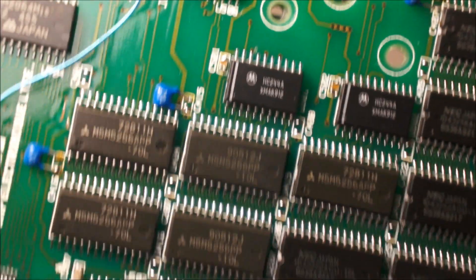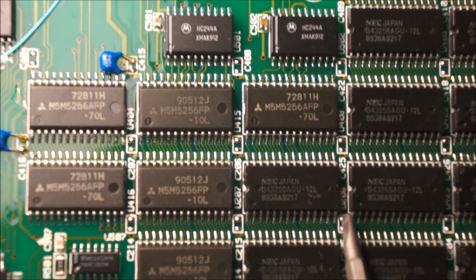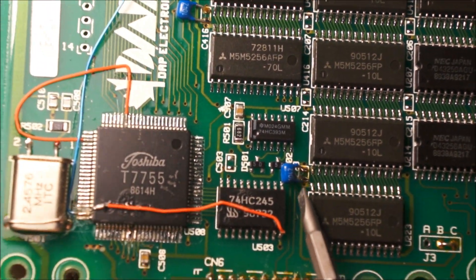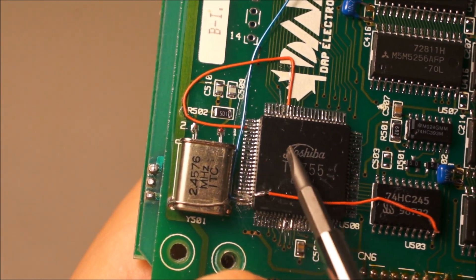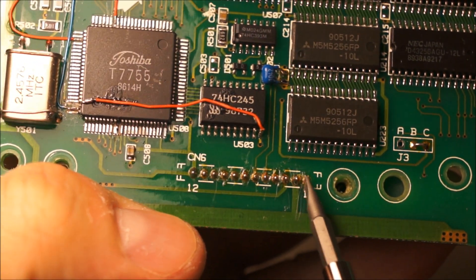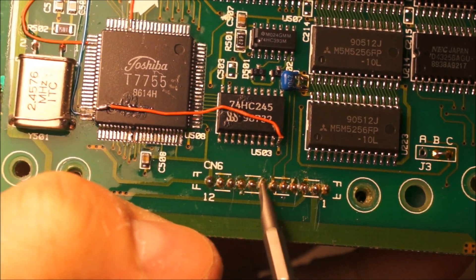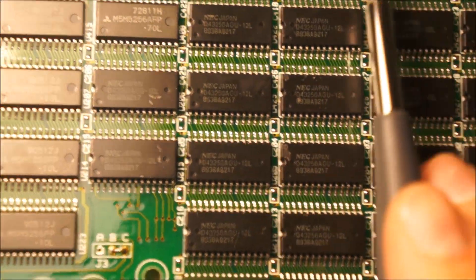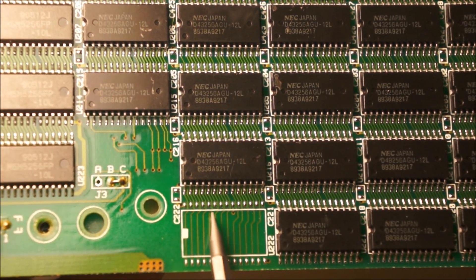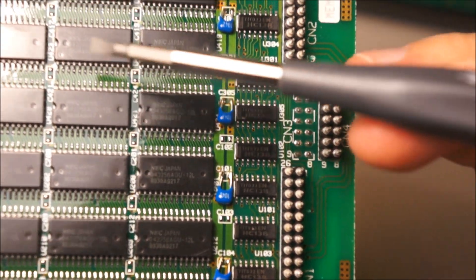There's a very nicely soldered decoupling cap — I guess they ran out of surface mount parts, so they started soldering through-hole caps onto surface mount decoupling places. This is just an utter riot — such a disaster. Look at this wonderful soldering job. There's just flux everywhere, and it looks like someone who isn't me has tried to scrape the flux between the terminals. There's big horizontal buses here. There's basically a bus that runs — this pin is connected to that pin, etc.